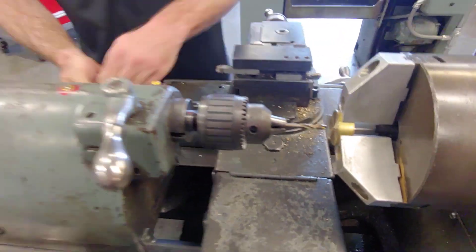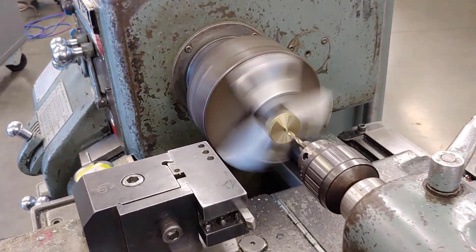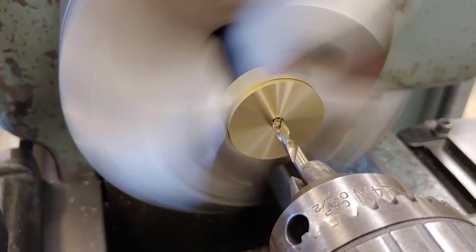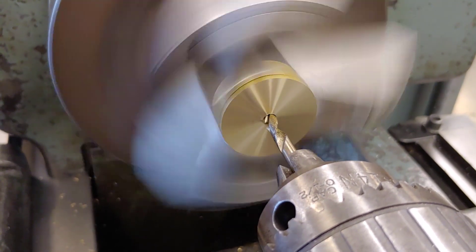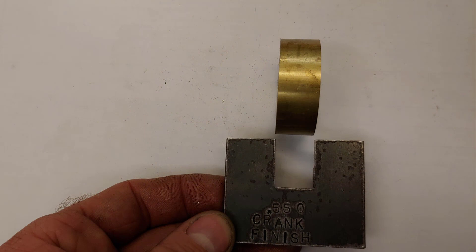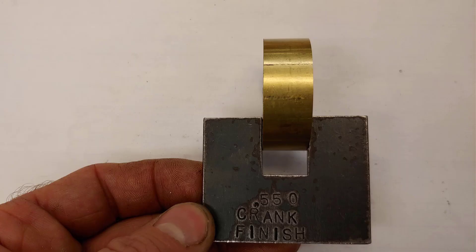After we're done facing, we have to drill an internal hole in the part so we're able to use the broach. We don't center drill during this operation — we're going to let the drill walk a little bit and just use the center of the drilled hole as our datum, because we still have to remove 50 thou on the outside diameter. Once we're done drilling, we use the crank disc's finished length go/no-go gauge to check the size. This gauge has the maximum material condition on the go side and the least material condition on the no-go side. If it slides on and stops at the limit, the part is good; if it goes all the way through, the part was cut too short and needs to be scrapped.